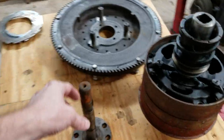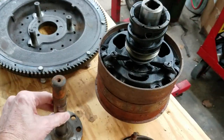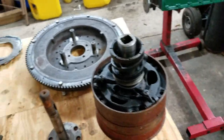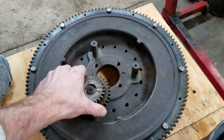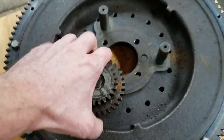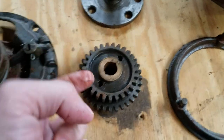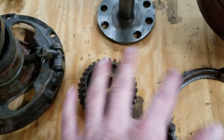I'm going to make a few videos on this piece by piece, and it's going to entail refurbishing and checking things like that for straightness, making sure that the bushings are all the right clearance — which they appear to be. You want just a little bit of wiggle, not too tight. Too tight and instead of spinning on this surface here, it'll spin on the outside, and it just tears it up and the gear goes all wonky.